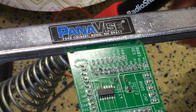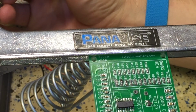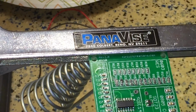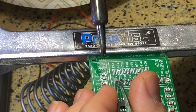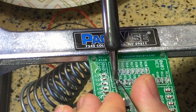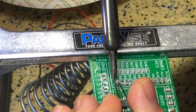There are just flakes of a component, right? So the soldering iron's heated up. I've added a little more heat to the soldering iron. Also, before I begin a session, I'm tinning it real quick, and then I'm shaking off the extra solder, and then wiping it on the wet sponge. Alright, so I am grabbing a hold of the component, getting it on there nice and straight, adding my heat, and quickly getting out of there. Alright, so I don't think that's actually over enough. Straighten that up.